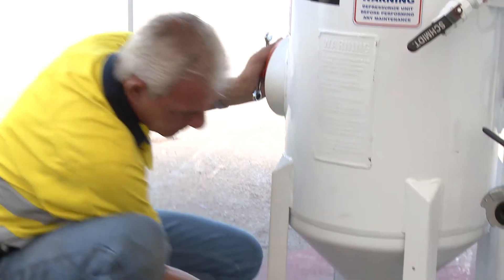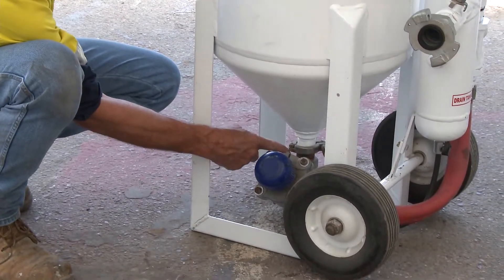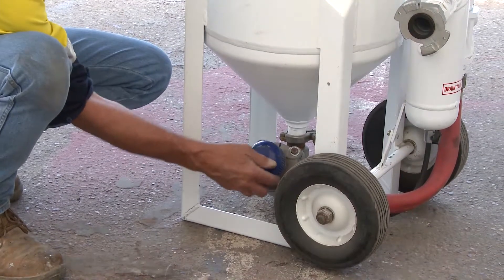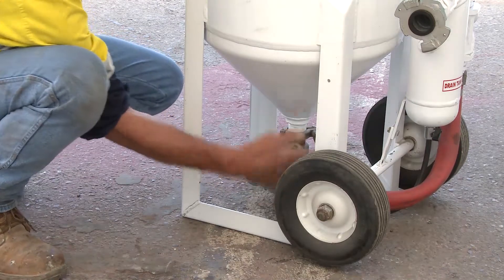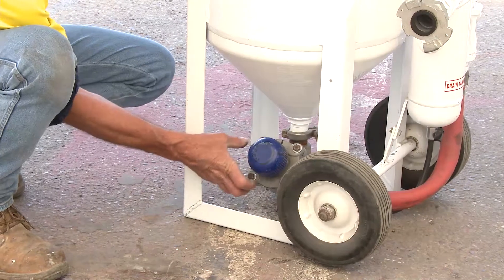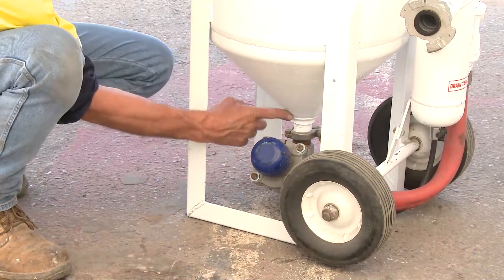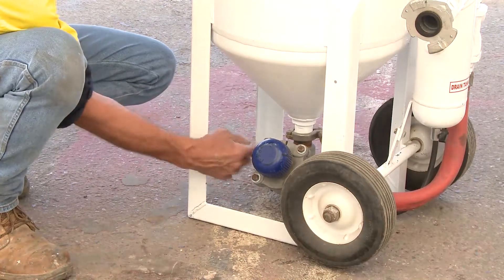At the end of this airline is the Thompson valve. The Thompson valve governs the amount of grit that flows from the conical section of the pot. It is activated by pneumatics. Inside the Thompson valve there is a piston — when air comes from the auto air valve down to the Thompson valve, the air pushes the piston upward, pulls it off the seat, and allows the grit to flow down through the body of the Thompson valve.